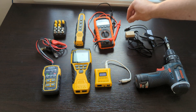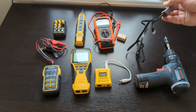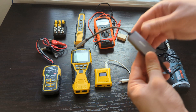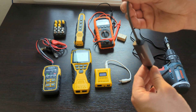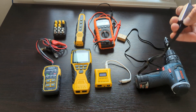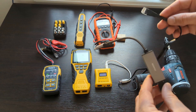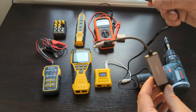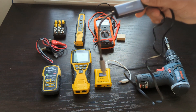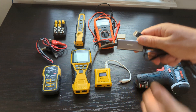Next, this is a connector. Sometimes it could be useful for connecting cables. This one is a small adapter from network RJ45 to USB-C. So you can, for example, without using a laptop, connect your phone or tablet to the network — to a switch or router — and receive network access and test it. You can enter inside the network, set up configuration, or just test the internet speed. This device supports up to 1 to 2 gigabits per second, so it's good to have in your set.